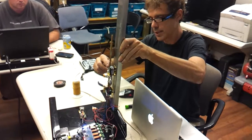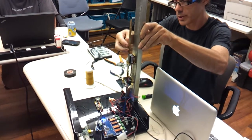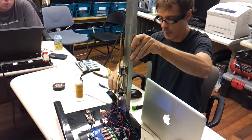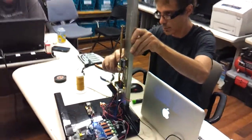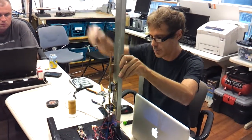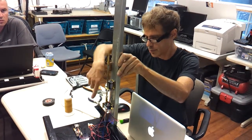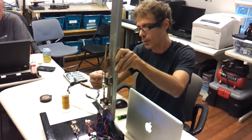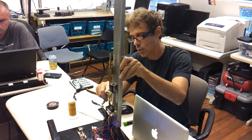and this mechanism right here, actually, if you turn this upside down so that the load are on this end, this is what is at the bottom of a drilling rig. If you ever look at a construction site where they're drilling foundations, this is the part that's on the bottom of the machine. The up and down part is a cable crane hoist, but then at the bottom there's an apparatus like this that's turned by a hydraulic motor, and that's what rotates the drill bit. Naturally, as the drill drills, the drive shaft has to be able to drop in the hole, and this is the mechanism they use.